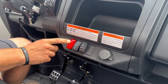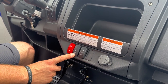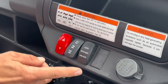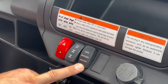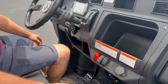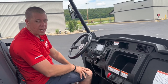This machine does have your four-way hazards. This right here gives you two-wheel drive, four-wheel drive, and four-wheel drive with front differential lock. This machine is also equipped with a turf mode — right here is the rear differential control. In unlocked mode, the machine is only driven by one wheel, the differential in the back is unlocked, and it will be really easy on the grass. Super cool feature — not a lot of machines come with that.